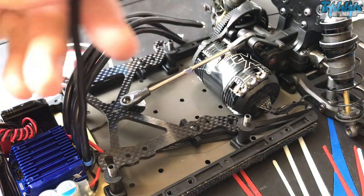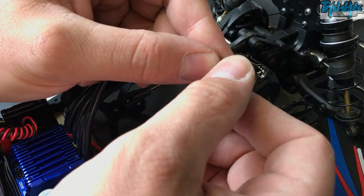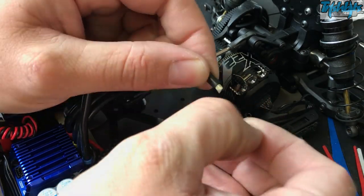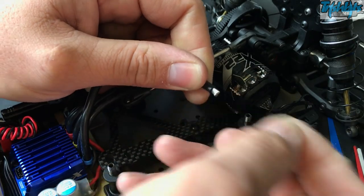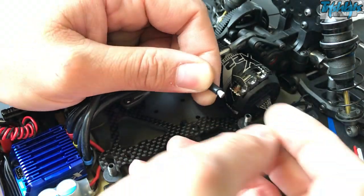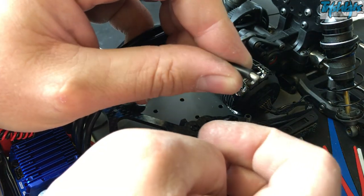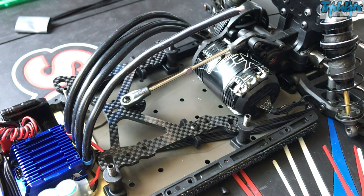After that I'll be getting my knife. Be very careful — it's very light pressure, no pressure really. Just roll it around that insulation, it's very soft stuff, and that allows you to just pick it off with your thumb. Once you've done that you want to twist the wires together — make sure it's round first. That's what I like to do, so it sits in the slot of the motor nicely. Twist all the wires together so once you get solder on them they're going to have a bit of structure. When you solder into any terminal and you push down with a soldering iron, it's a structure to hold itself as a cylinder.